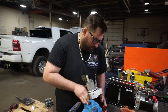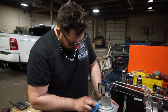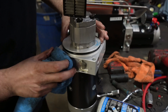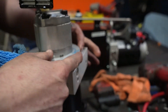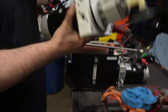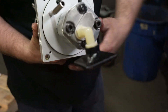Now that we got those back on, we're just going to take a rag and wipe any dirt or grime off this o-ring here, and then we're just going to inspect it — rub your finger around it, make sure there's no nicks, make sure it's not stretched out, nothing like that. Then we can take the motor — make sure your filter is pointing down.